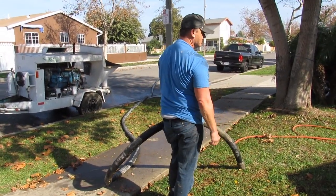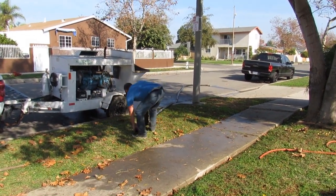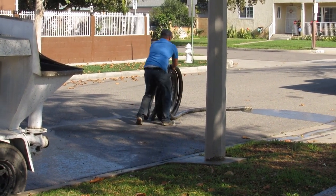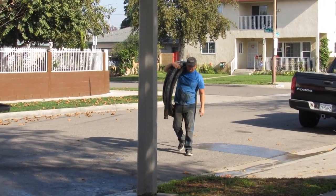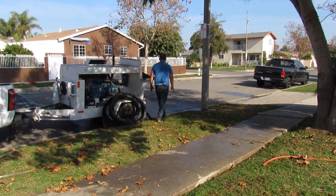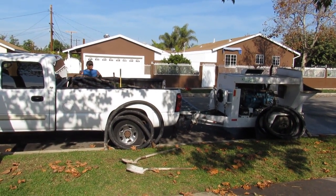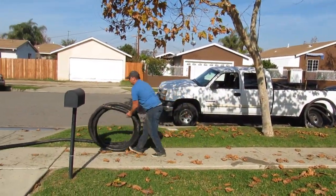That's about 35 minutes from start to finish washout — 300 bucks. Pumping is a super good way to make a living. Southern California down by the beach, the weather's not too hot, the mixes are pretty good. Just roll the system up and I'm down the road to the next one. I put the 50 footers by the tailgate and the 25 footers up by the cab because the 50 footers are heavier. There's the washout hook — I just put it up the side, and that's a wrap.